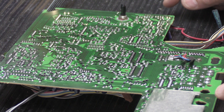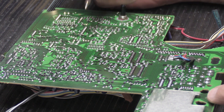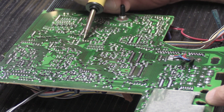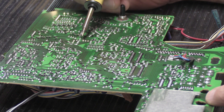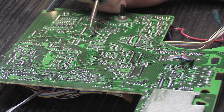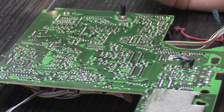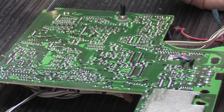I've seen a lot of people do a lot of weird things with desoldering. One of the standard ways I see people do it, which is wrong, is they take their soldering iron, heat up the pad, and try to push the leg of the component back through the board to make it loose, then move to the next lead and the next lead trying to push it out. That's bad — don't do that.